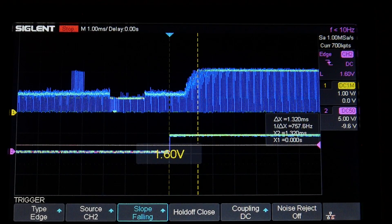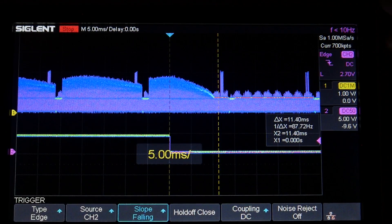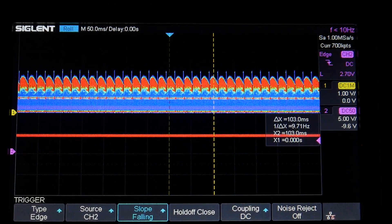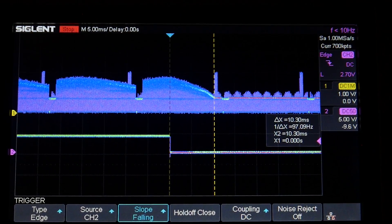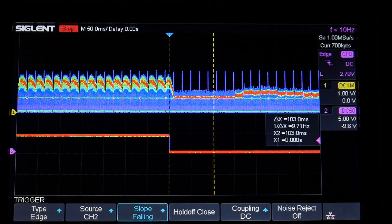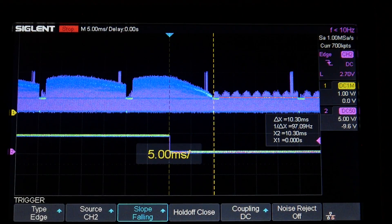Now we're going to test when the LED turns off. I'm setting it up so once the LED drops below the line, we take the sample. There we go — we can say roughly that's when the LED turned off, and we're getting 10.3 milliseconds. Still well below the 20 millisecond range. All cameras show larger latency when the LED turns off. Let's do that again — still 10.3 milliseconds. Zooming in again, 10.3 milliseconds. It's really that consistent — their cameras are unbelievably consistent, it's out of this world.